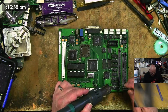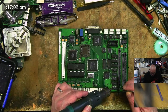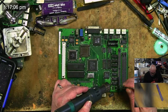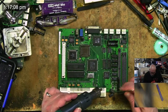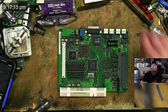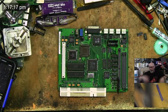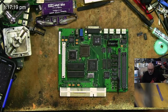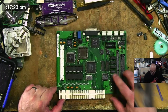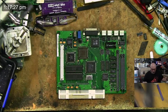A dreamy sound. So I'm taking a couple of chips off the other end, just because why not? Okay, so that's those ones. So far, I don't think there's anything wrong with any of these. And of course, it may not even be the RAM SIMs. It could be something else, like a MUX chip or something. I have to have a look at the schematic. If replacing the RAM chips doesn't work, the schematic will be next, and we'll see if there's another chip associated with the RAM that we might need to look into.